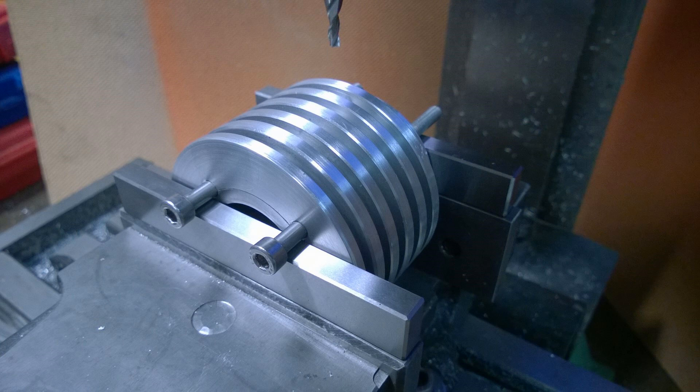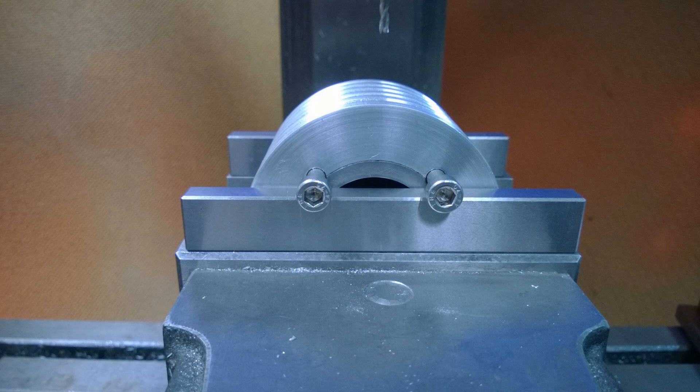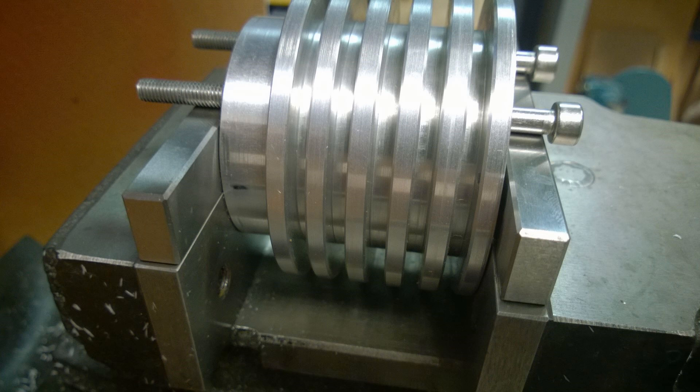As you can see, I've set up the cylinder blank in the vice. What I did at first was use the main head bolts to give me a horizontal reference, because the port is on one side and the exhaust port is on the other. But the problem with doing that, as you can see in this picture, is that at the back it's actually sat on threads, not on the shank of the bolt. So I quickly replaced these and used some 4mm drill rod instead.